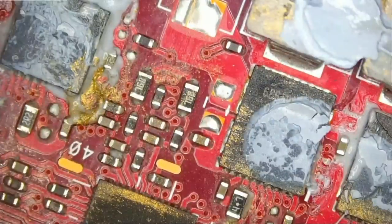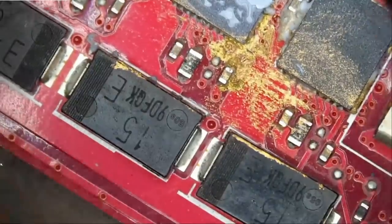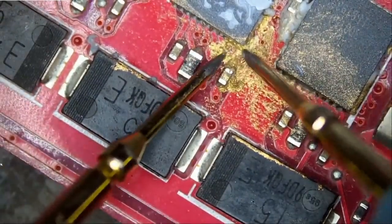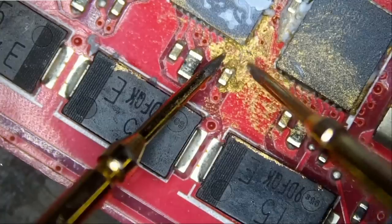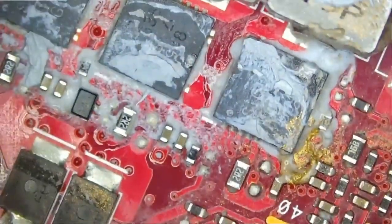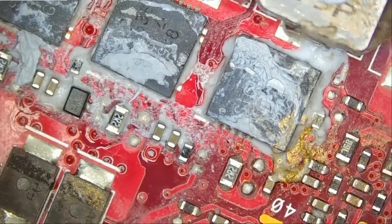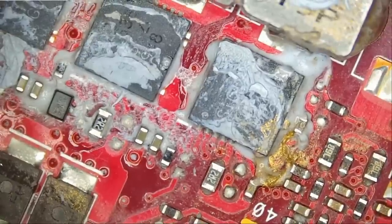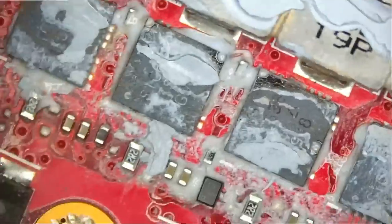Maybe glitter spilled on the laptop, or I do not know how this got on the motherboard. And it's not conductive, so that's good. We got that out of the way. Let's inject voltage at the drain and see what gets hot on the board. We're gonna monitor the board under a thermal camera and see if we can figure this out.